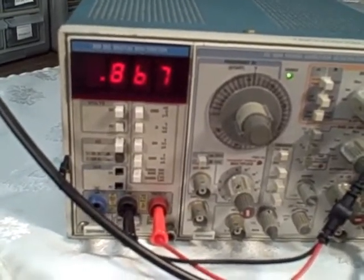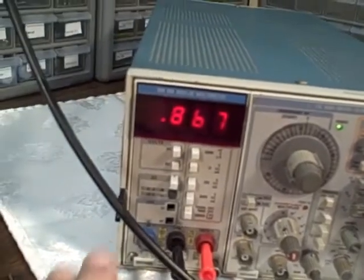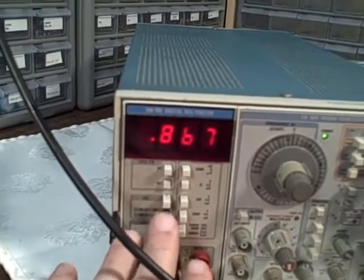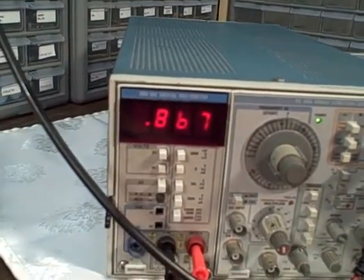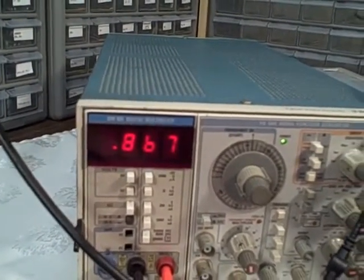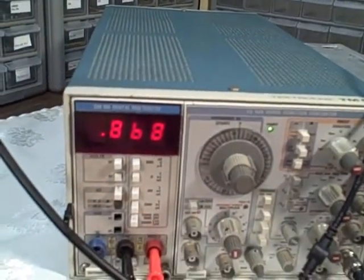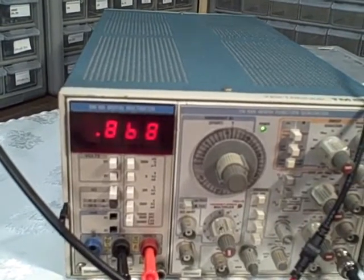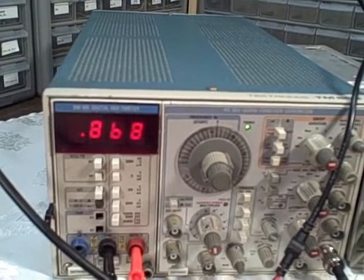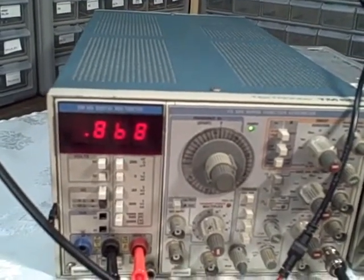The DC was reading pretty good. I tried the resistance, but there is no output voltage coming from the resistance section, so we have got a problem in there that needs to be resolved. So it will be a project for somebody — I wish them luck. It can be fun at times and it is rewarding too if you can get everything working well. This one has enough going for it that I can see that happening.